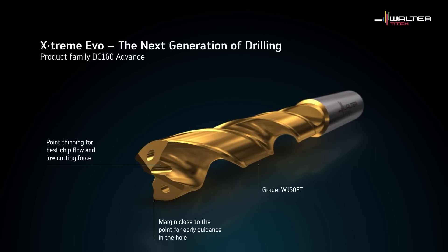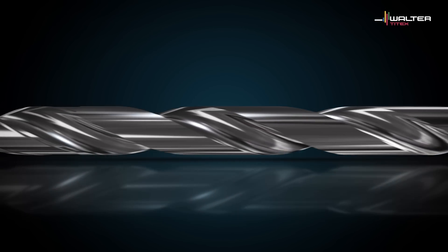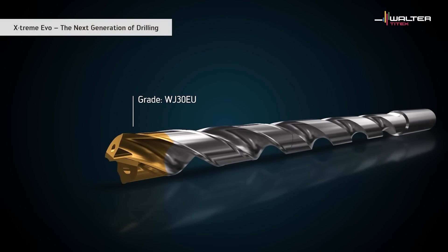For our more observant viewers, you'll notice the drill is only half coated — there's coating at the front and a bright finish on the rear. That's right. The drill has a wide range of diameters and length-to-diameter ratios. The program starts at 3xD and goes up through 3, 5, 8, 12, 16, 20, 25, and 30 times D. The 3, 5, and 8xD drills are fully coated on the flute length to give speed capability and tool life. Once we get to 12xD, we coat the point only and leave the flutes bright — that gives secure chip evacuation down the flute. That point-only coating remains on those length-to-diameter ratios all the way up to 30xD.